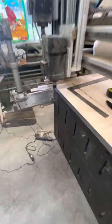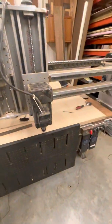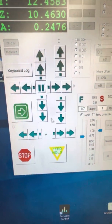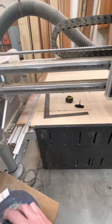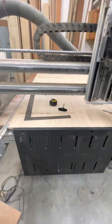You can see what we're talking about — that's the one side. Pull it around, go to the other side. A up, and we'll go back down. A little bit further — we'll go beyond and then we'll bring A back down. Inch it up, creep it up. So there it is. We know that this front edge is in line to the travel of the y-axis. Perfect.